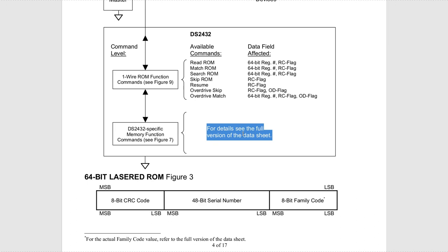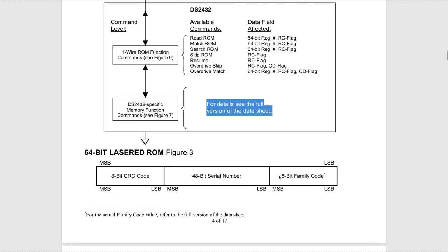But they're using a normal cryptographically secured hash algorithm, or at least it was at that time, SHA-1. And this has been reviewed by a lot of people to be sure that it is, or it was, secure. And here, they're just removing it and doing security by obscurity. This is really a pain. This doesn't make the product more secure. This just slows down. And for the programmer, it's a pain in the ass. It won't stop any evil counterfeit market.